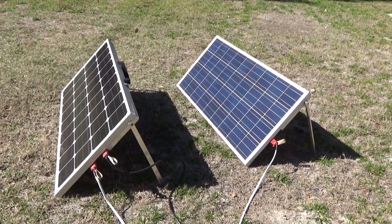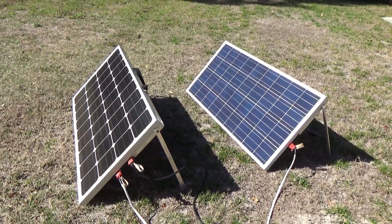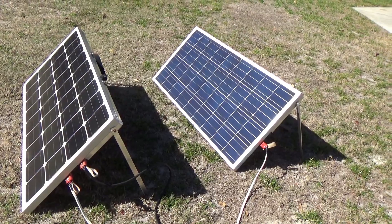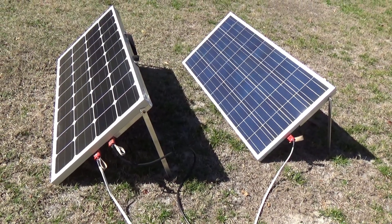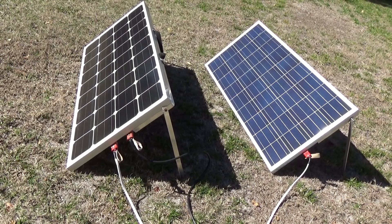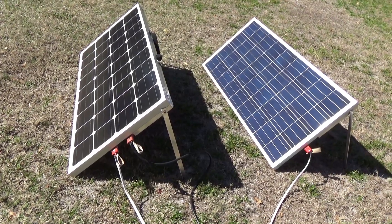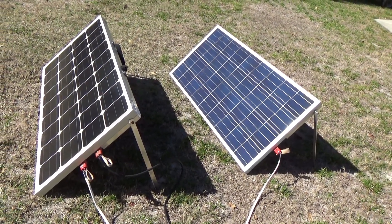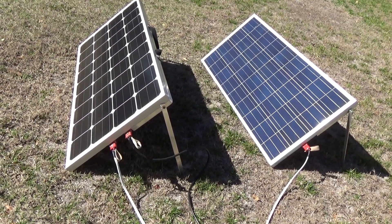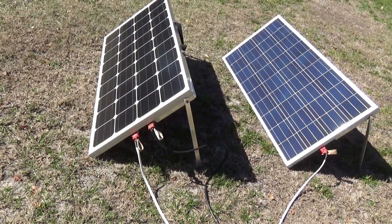The total power here is 320 watts rated by plate. I've gone ahead and used Anderson-style power connectors, which I wholeheartedly recommend if you're making something you're plugging in on a regular basis. These connectors are designed for multiple cycles of insertion — they are high pressure, low resistance, silver-plated connectors. They're not terribly expensive but very durable and reliable. You certainly would not want to use the MC4 connectors that come with the panels, as they are not designed for repeated insertion cycles.